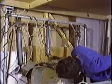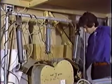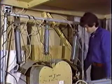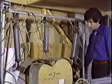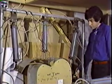Okay, why don't we put the pressure up at about 25 pounds, and we'll bring it down a little bit faster. There we go. Okay, now I release the second valve, which will open these two air cylinders and allow these two air cylinders to force the outer strap down over the mold. And I'm going to let this go gradually. Okay, let's drop back down to about 10 pounds of pressure.